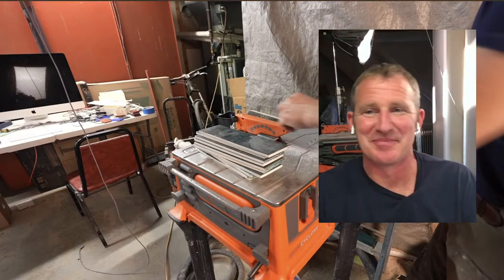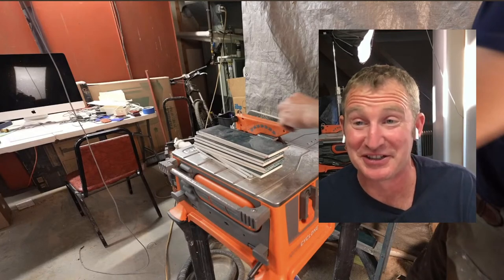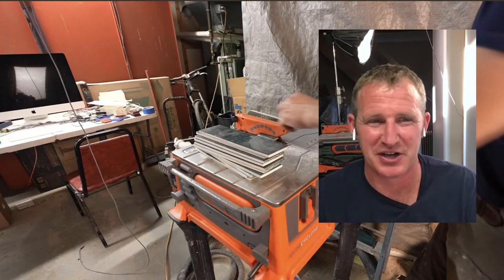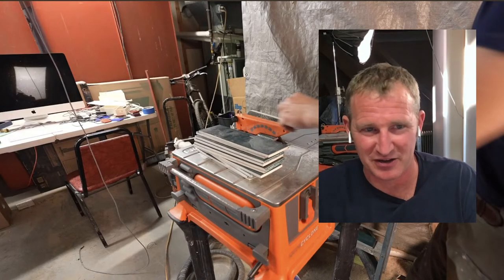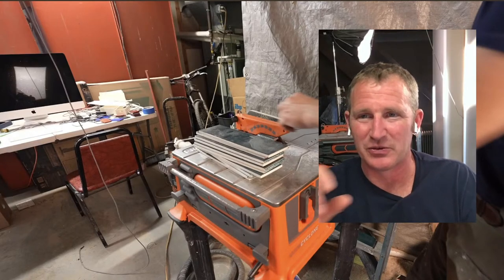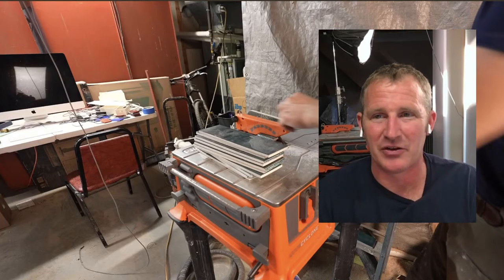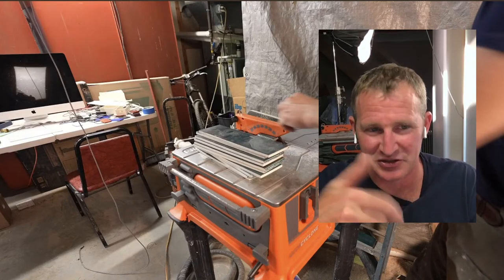As you can see, that really has almost no dust — it was pretty impressive when it comes to being dustless. You do get a little bit of grains flying off on bigger chunks, but there's literally no smoke. If it does start producing dust, it's primarily because your tray needs to be cleaned out, or the HEPA filter cartridge is clogged — you just need to spin it to clean it without even removing it.